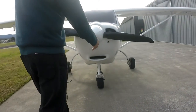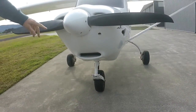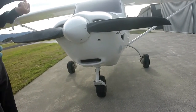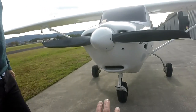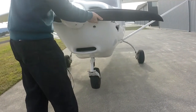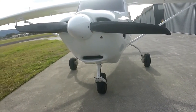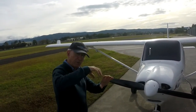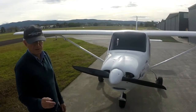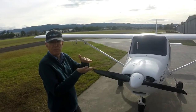We can also just lift up and down a little bit and see that the nose leg is moving freely. On some aircraft like those with an oleo strut, if someone's landed on the nose wheel and bent it, it will be binding or jerky. On the Alfa and Cessnas you've got an oleo strut moving up — if that's been bent it'll be stiff. On the Cessnas particularly they use air pressure to provide the spring, and if they've lost air pressure the nose leg will have collapsed and be sitting down too low.